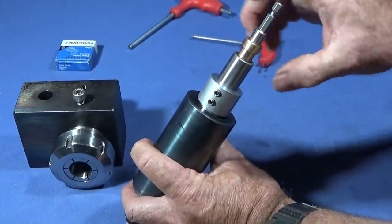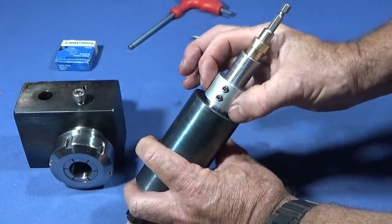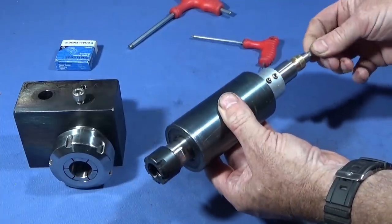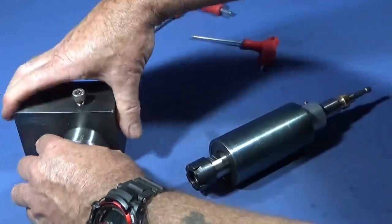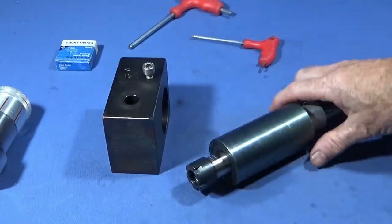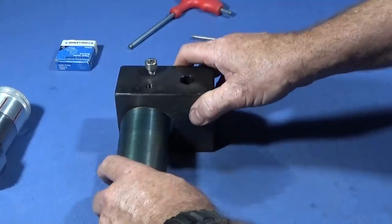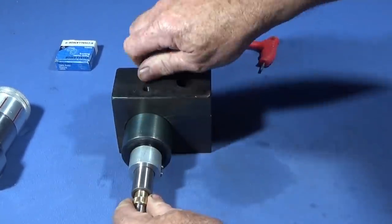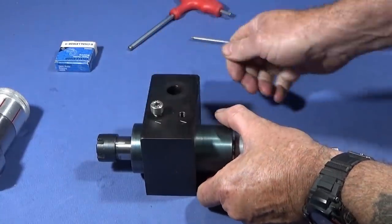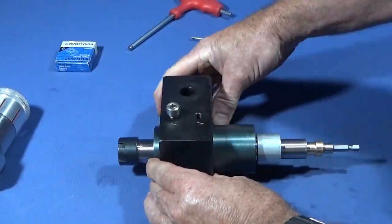I've made this diameter here so it'll sit up against the back of the spindle part here, but it's smaller than the actual diameter here, so I can actually take this collar off. And then I can use an ordinary electric drill on the lathe to actually drive it. And I can do both ways, so I can actually do the face of a component that way round, or I can put it in this way round for doing indexed holes around a diameter of a piece of work. So it's a great piece of kit, and it locks into the tool post with this one here, and obviously you can slide it backwards and forwards to get whatever movement you want on the cross slide.